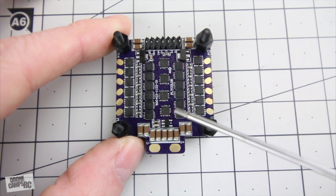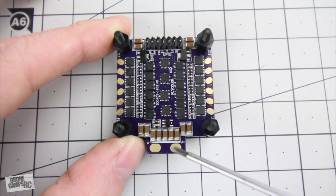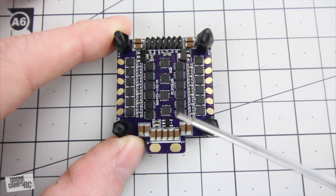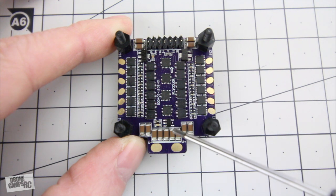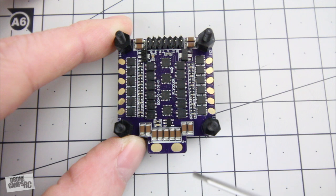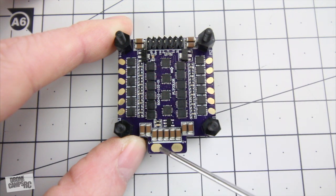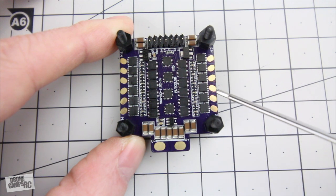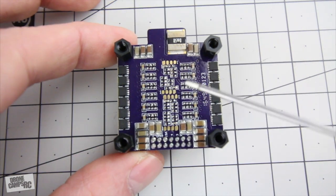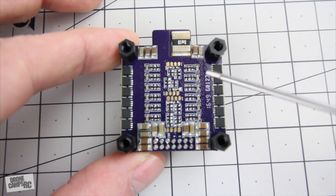After soldering the motors, go into Betaflight or Cleanflight — whichever you want to use — and make sure your configuration is set to the correct ESC firmware, like DSHOT. They are BLHELI, so if you want to get into it you can go into BLHELI suite and update the ESCs as well. On the very back of this board you have two tabs for your battery connection, and battery wires are included in the box. You also have four standoffs included, and the solder joints on the bottom look really clean — super tiny work on this board.